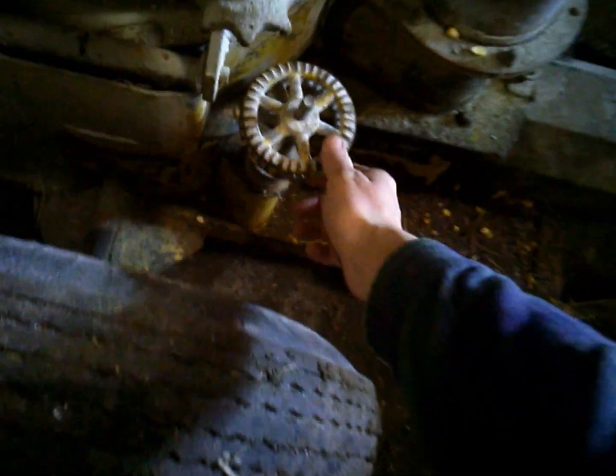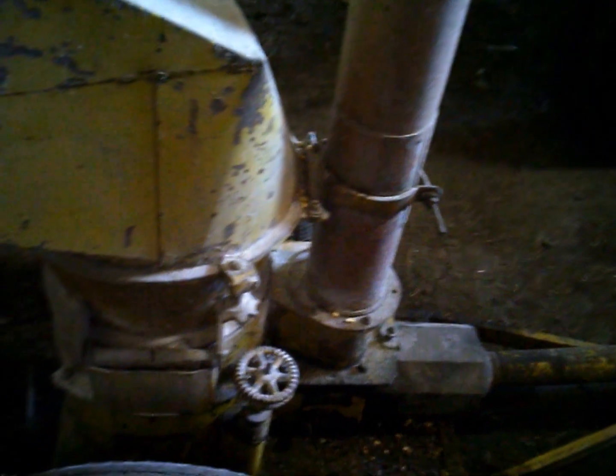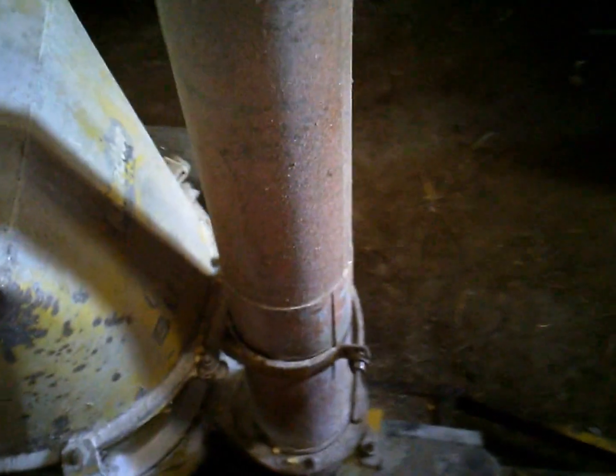To change the burrs, there's a bolt — take that bolt out and this whole thing just flops sideways. It pivots right there and you just lift the burrs out. Then you take the two 5/8ths bolts off, pull the cone piece off, and change the burrs. I can do it in about five minutes. This knob here is how you adjust how close the burrs run together. Then it grinds and goes into this area here — it's got little paddles that push it over and runs it up out the auger. This auger here just keeps turning around and around. Once you get it in the position you want, you tighten up this bolt to hold it in place while you're grinding, then loosen it and spin it back when you're done.